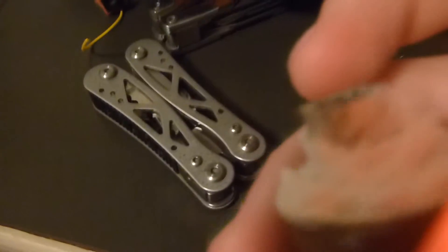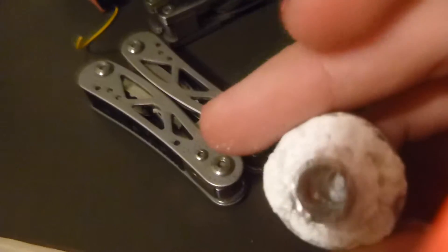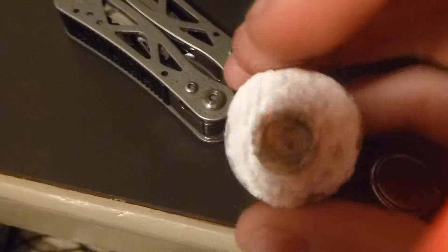These two batteries here are made with aluminum — you can use aluminum or magnesium. This is my first battery that I made. This one puts out around 100 milliamps. The amperage decreases the more the battery is used — it goes down and then it levels off like a regular battery discharge curve, except in current not voltage. This gives off about 0.5 volts instead of the 1.4 volts that the magnesium does, about the same current.